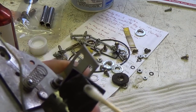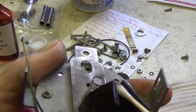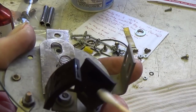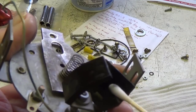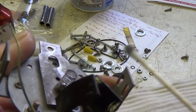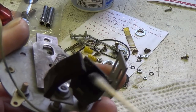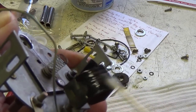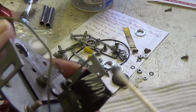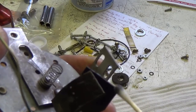in a layer of the Union Carbide special oil. We don't want them to be dry against the disc because they might abrade it. Okay, so we'll apply, and also this is cleaning the disc. You see how some of the black comes off. Okay, we really have to take care of that anodized disc because that's the key to the whole device and no one knows how to remake them.